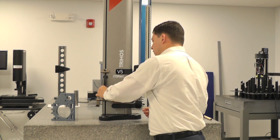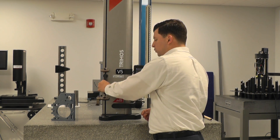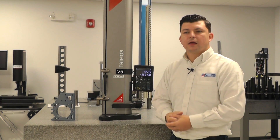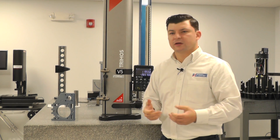What we can do is lock that. If we take this little knob in the back behind our quick travel hand wheel, we're now eliminating that float. That's going to be very critical when we want to take a perpendicularity or squareness measurement.